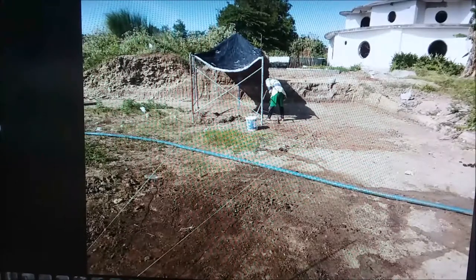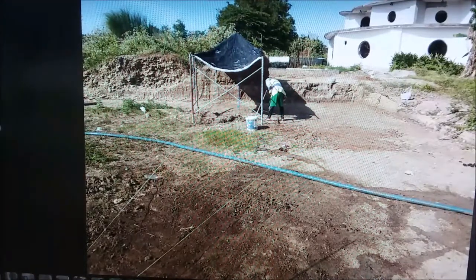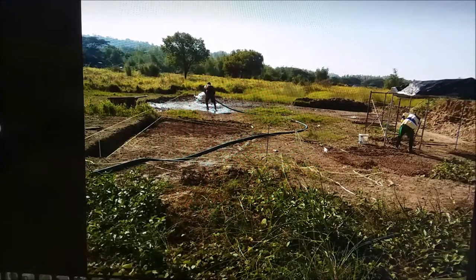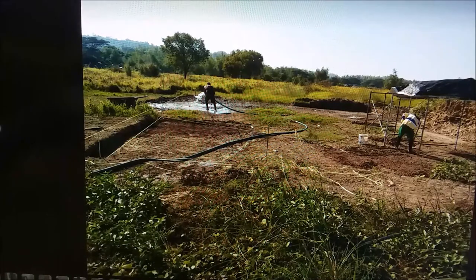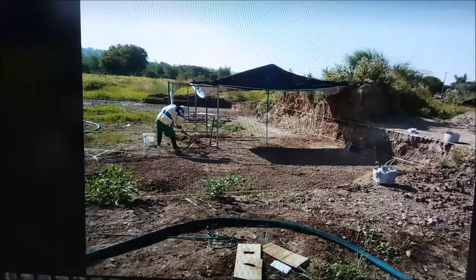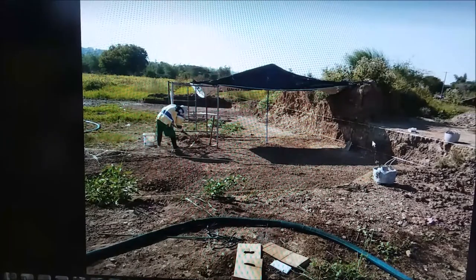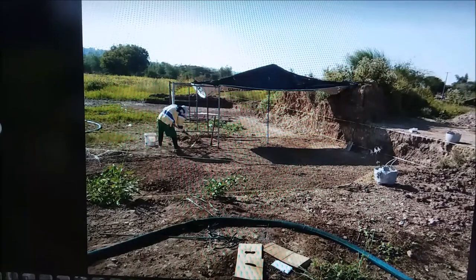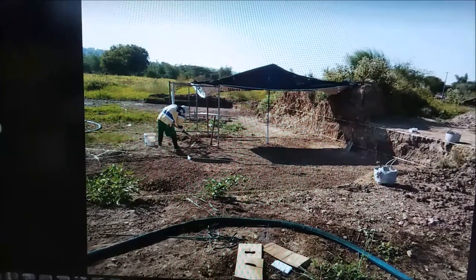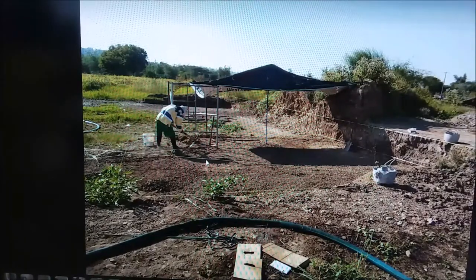You can see how tall this pile of dirt is that they were going to be digging through. I just told them to move the whole thing straight south and that's what they're doing. He's watering down some more over there. This looks like a big slab but it's a pretty big solar array too — 21 kilowatts: 700 watts times 30 panels. There again is that mound of dirt I just don't care to pay to dig. They had made dirt stairs to carry stuff out for backfill but they've cut those back now. He's got a mattock out there trying to chip this away. The strings are level by the water level but they'll go back with the water level on a pole to check the area — the strings just tell you if you've got a big hill somewhere.